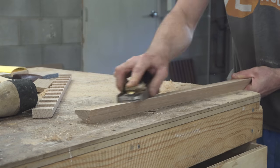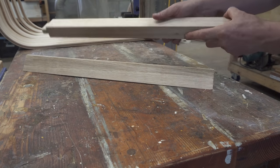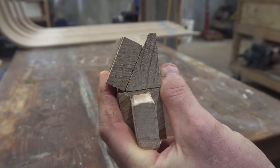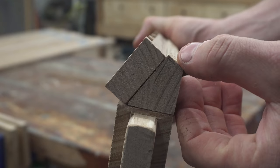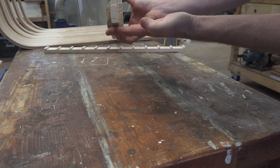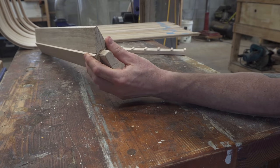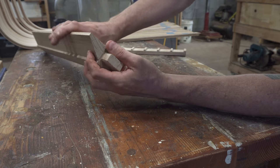I've cleaned up that angle piece and it's ready for glue — it will eventually take this strip which will sit against it. I've taken the chair apart; this is the back rail that this angled piece is going to sit on, and then take this strip like that. Now I'm going to cut this angled piece to follow this line. Where it becomes a bit tricky is once I cut that angle and try to clamp the two together, I'm not going to have opposing angles. So to get around that I added some dowels under this piece — even though it's going to be on an angle and wanting to slide apart, those dowels are going to hold it together. The dowels aren't really there for strength, they're just there as locating pins.